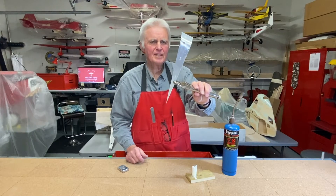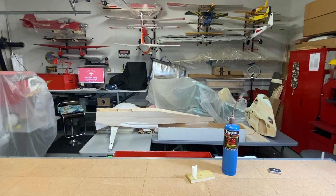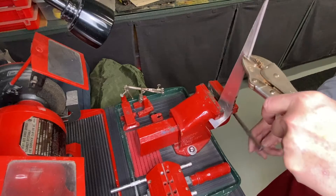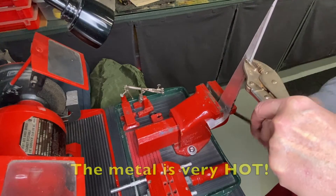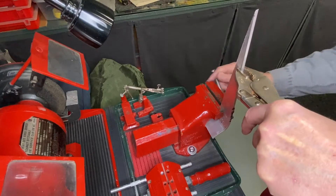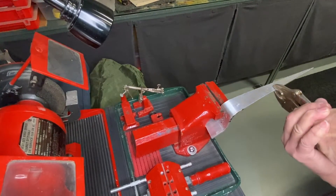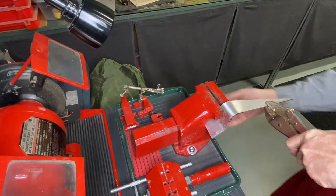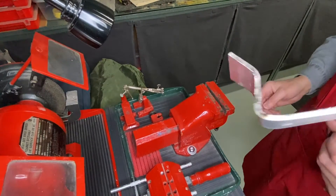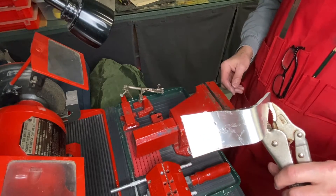The soot is now completely removed. It would be advisable to be wearing gloves during the whole heating and bending procedure — I couldn't find my gloves in the shop. Aluminum conducts heat very readily so the entire piece is very hot. Now see how easily it bends with very little effort — you could never do it if it wasn't heated.